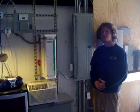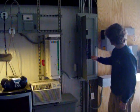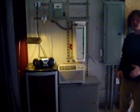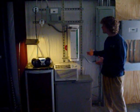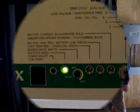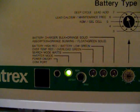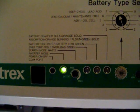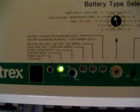We're now going to demonstrate a utility grid failure by cutting off the 30-amp breaker to our inverter. As you can see, the inverter instantaneously recognizes that the grid has failed and begins to pull power from the batteries to maintain our critical loads. In this close-up example, you can see that since there is no power being provided by the utility grid, we are strictly in inverter mode, drawing power stored in our batteries to power our critical loads.